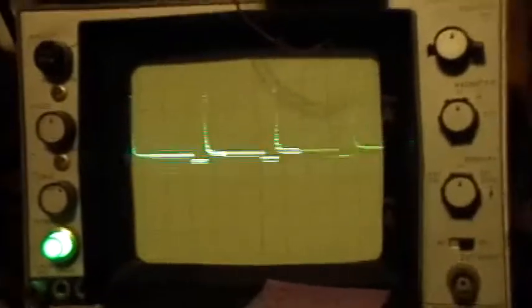I'm going to tune the pot towards the lower resistance now — lower and lower. The width of this small notch right down here, that's the drive pulse. That's the duty cycle, and then the height of this peak is the high voltage portion. As I turn towards less and less resistance, you can see that the drive pulse gets longer, but the high voltage goes away, and the motor actually decreases RPM.